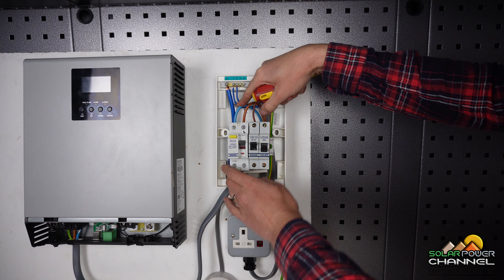That brown wire then goes out through the bottom and into our plug socket. It comes back out of the plug socket and through this blue cable to this bar, then into the main blue cable — which normally comes pre-wired when you buy the consumer unit — and into the bottom of this RCD. It flows up through here and back to the inverter. We do exactly the same thing for our light bulb circuit, which is just below.